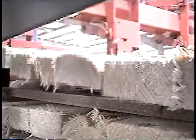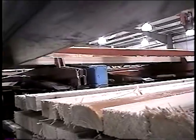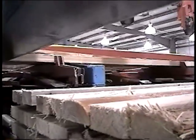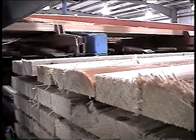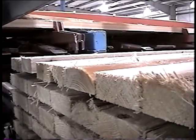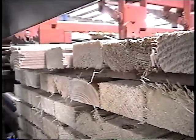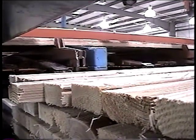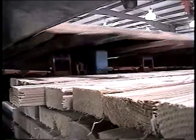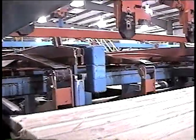In this side view of the zero-foot sticker, you can see how the sticker is trapped under the lumber as the lumber and stickers are raked off. This is what creates the perfect sticker alignment in each package. The forklift roller can be observed under the zero-foot fork. These rollers are part of the forklift rocker system. Lift is provided from a back-to-back cylinder, which we will observe in a later scene.